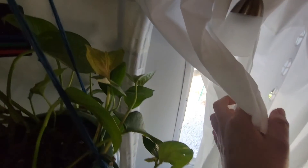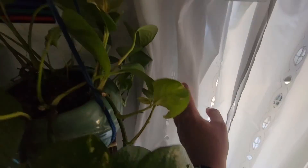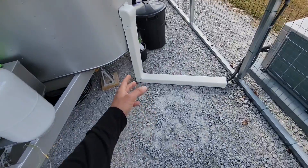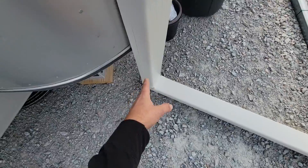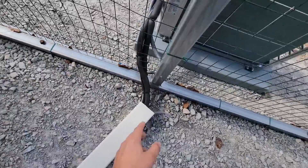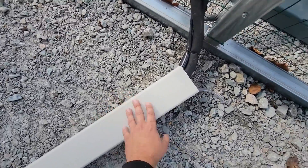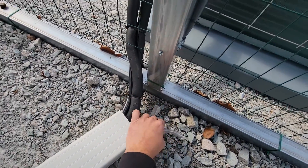Looky there. Looks like you've got some white covering, some tape there just to make it blend in. Wire tied the line sets. Beautiful. These are the line sets and the line hide cover looks great. It's sealed properly. We got the hole cover. We got the four-inch line hide cover coming down to our 90-degree line hide cover fitting, and then our line sets come out and they go into the outdoor unit. Most of it is covered — these will protect the line sets. And then this right here is the drain that comes out from that indoor air handler.